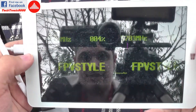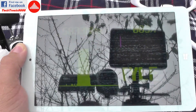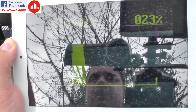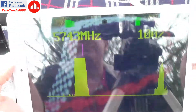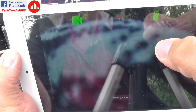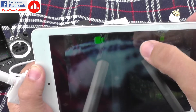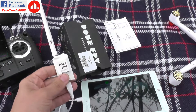If I press this button and keep it pressed for a few seconds, you get the FPV style interface and it starts to scan all channels. This device has 150 channels and it automatically chooses the one with the best signal. Of course you can also manually search and choose your channel. You can see it has a spectrum graphic here, and it has finished the scan and found the best matching signal. Now I have image from my drone on the tablet, and you simply press the record button to start recording from this receiver.